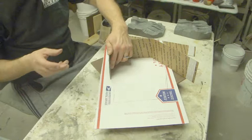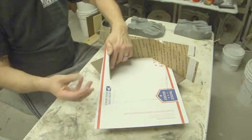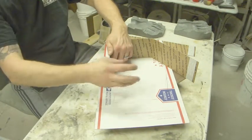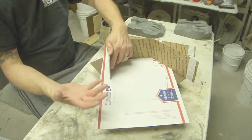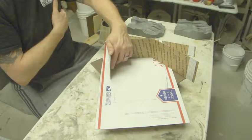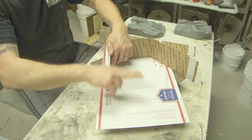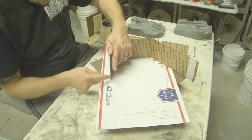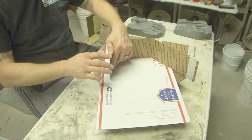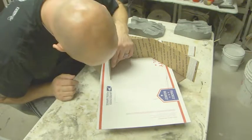Now the horn mold that I showed you earlier, the little round one, was basically made by hot gluing the horn that I wanted to mold onto a board. Then I took just a cup, depending on the size of the cup. I think it was one of those little 12-ounce ones, or it may have even been a 5-ounce Dixie cup, and I just hot glued it around the base, then cut the top of it off and put the silicone in the top. That worked really easily and gave a nice easy wall, so we're not actually having to create the box on that particular one.